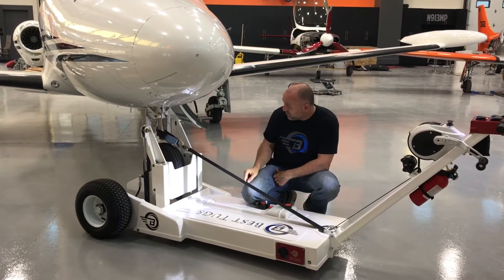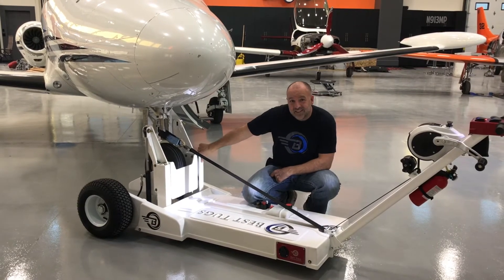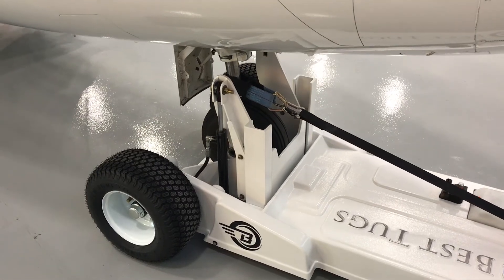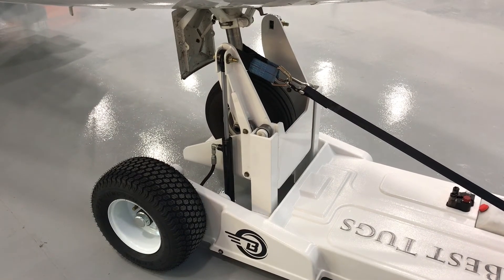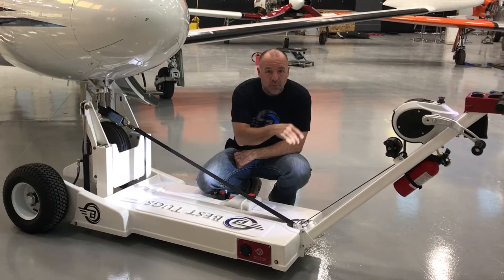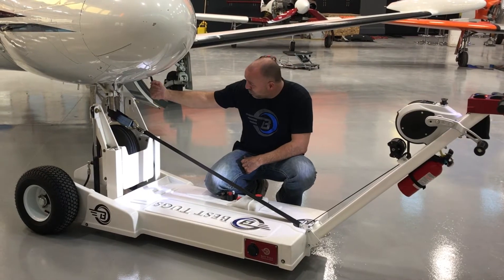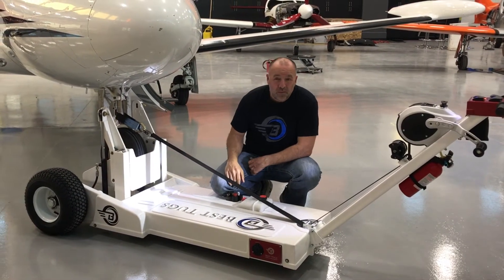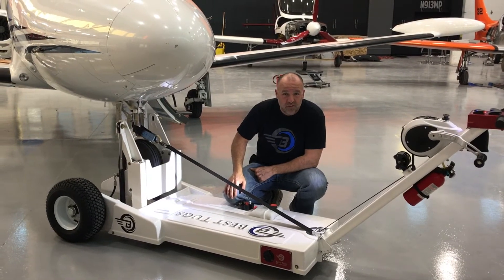Here's our new high lift option. Instead of three inches of lift, it has a full ten inches of lift. And not only are we using hydraulics and actuators to lift, we're using hydraulics and actuators to draw down the lift — and here's why that's important. Instead of just pushing a button and dumping the hydraulic pressure, if it's a lightweight airplane, the plate would come down so slowly that you'd take a nap waiting for it to finally push all the hydraulic fluid out of the system.